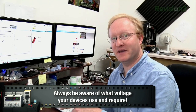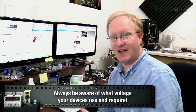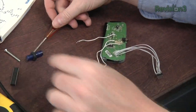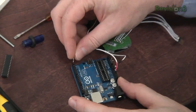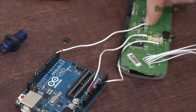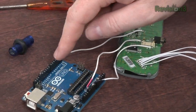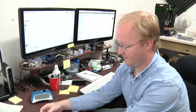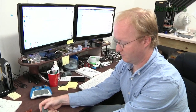Now that we've reflashed the program on that PIC, let's see if it works as a serial ASCII keyboard. We're going to remove the AVR from the Arduino, which allows us to use it as a serial terminal. This thing's going to send out its data into the Arduino's transmit pin, which should hopefully get it back into the computer. I guess we'll find out — Hello world.